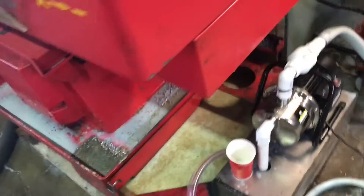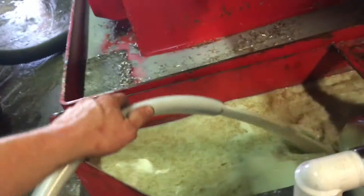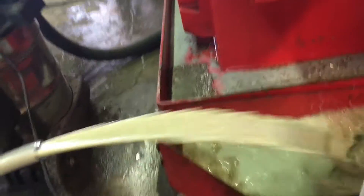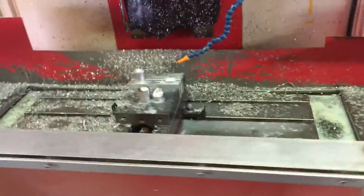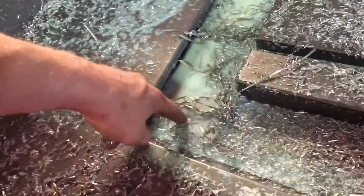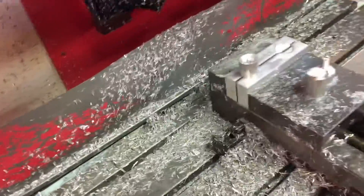I made a colossal mess earlier and discovered that this thing works really, really well — that is all the pressure I will ever need. But the problem is the entire bed fills up with coolant, and then the coolant runs between the splash guard and the bed, coming out and dripping down here making a huge mess. The only way for the coolant to drain is a passage in the back with a grating, and the chips flow back there and clog it up. I have to figure out how to get the coolant off the bed while keeping chips in and not overflowing.